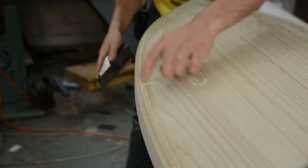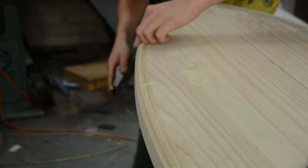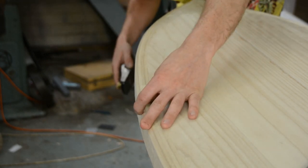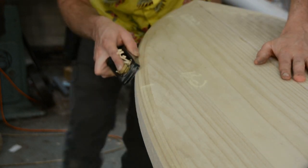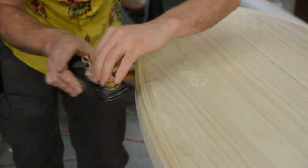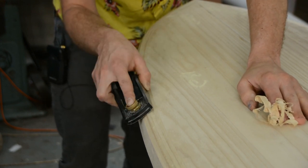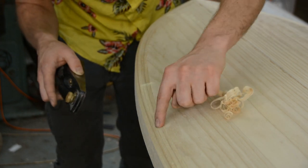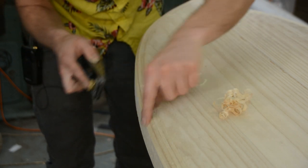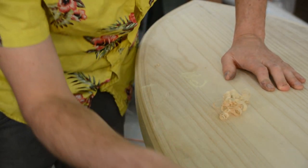You can see that now we're starting to get a really good bevel here — this is about 45 degrees and we're pretty even along the entire length, so it's probably about nine millimeters wide. Now we can start working on making it round. We were at 45, now we start tipping our plane over to take off the new edges we established — we've got this 45-degree shoulder with these 22-and-a-half degree edges — and we're going to split that angle and start working on the corners we've just created.